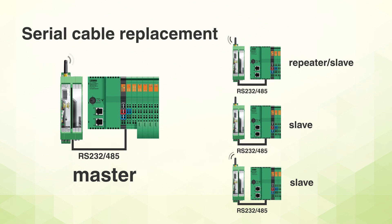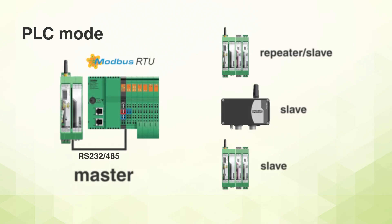The wireless network is completely transparent. Three: in the PLC Modbus RTU mode, the I/O signals of the remote stations are output at the master RadioLine module via Modbus RTU protocol. This reduces the potential number of I/O modules in the cabinet, reducing cost and space requirements.